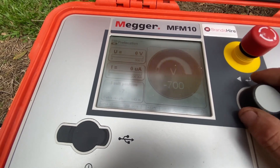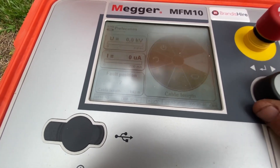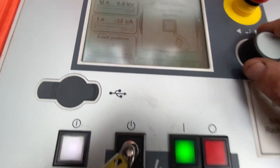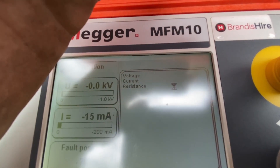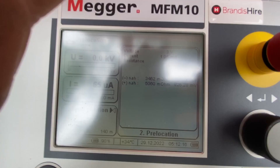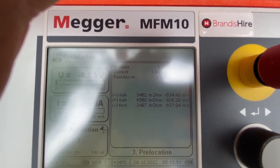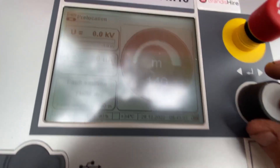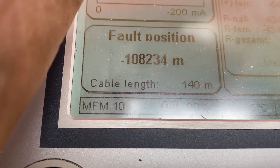Select my voltage, do it at one kilovolt. Cable selection - we'll just leave that on normal. Press the green button. Voltage, current, resistance... okay, you got some results - about two kilo-ohms. Still oscillating positive, negative, positive, negative. Okay, test results are in. That doesn't seem right - my fault position is negative. Doesn't seem right.